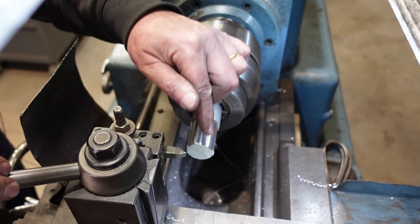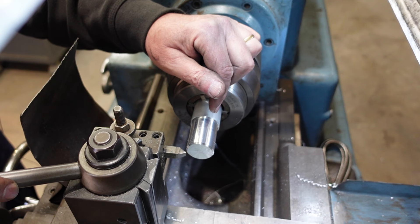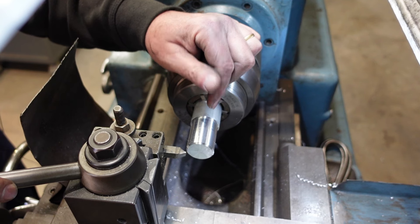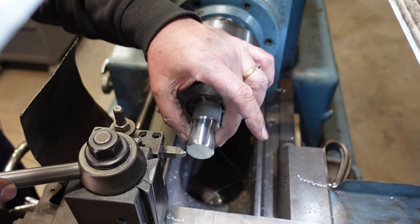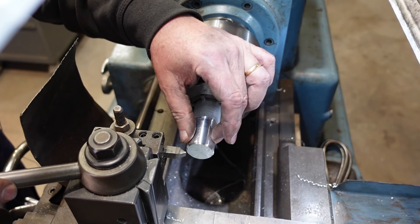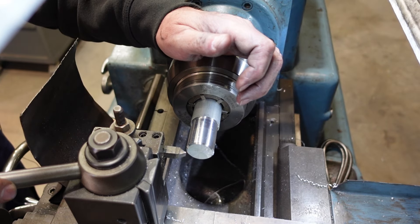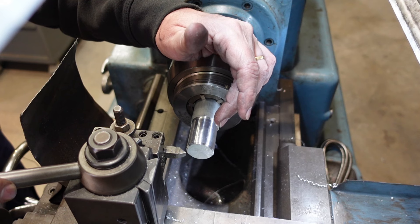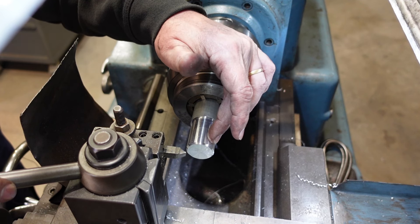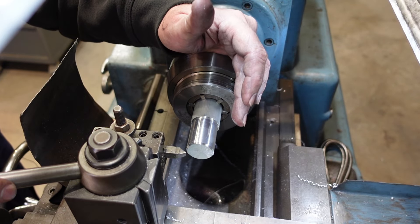As I usually do, the first thing I want to do is make up a sort of plug gauge to try the thread. I'm not sure what size it is - I think it's an M30 by 3.5 - so I've got everything set up to a 3.5. I'll measure the thread with my thread mic to get a good nominal thread, then take it out and try it in the existing part to confirm the thread, and also use it to check the hand wheel thread I cut is to correct depth and size.